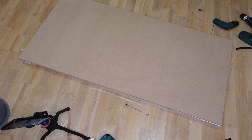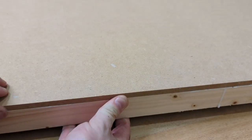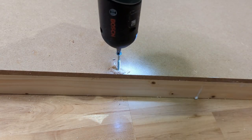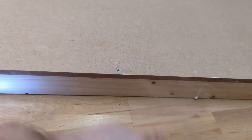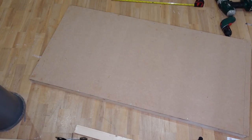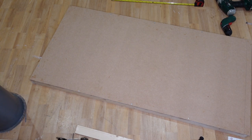We're going to start on the middle of one side and then on the short side. I'm just going to line up the wood and the top so it's all nice and flush, and just do what we did before — drill a hole, countersink it and pop a screw in. I'm going to work around the outside of the board making sure that we have lined this up as best as possible, and everything should work out nice and flush. Now all those screws are in, that's putting pressure on the glue, so we're going to let the glue dry.